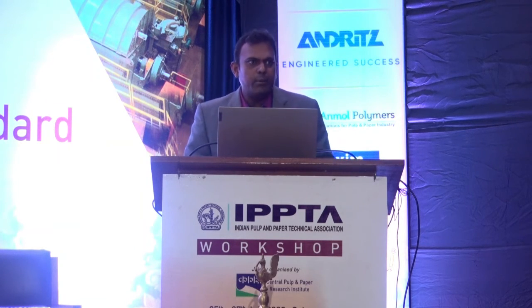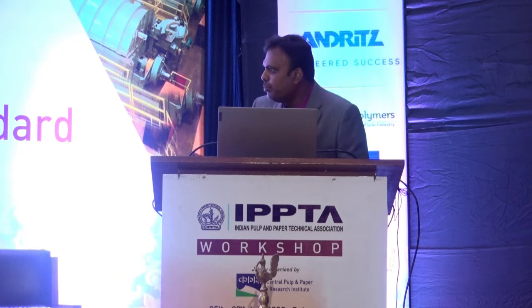We talk about this benchmarking. We have the cooking yield almost similar for this bagasse mixture, 50 to 51%, and kappa number also 12 to 14. But if you take MP steam, that is almost 1.5 to 1.7 tons per ton of pulp. That is one of the major concerns for annual fiber. If we talk about wood handling for wood-based softwood or hardwood pulp, we need only 0.7, whereas here we are talking about 1.7. Almost 1 ton more steam is required in the annual fiber. So this is the one major concern that we are working on.